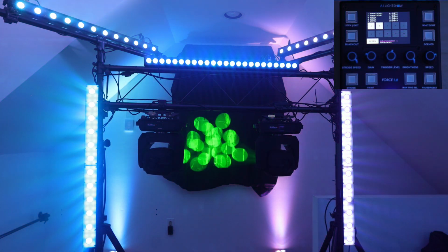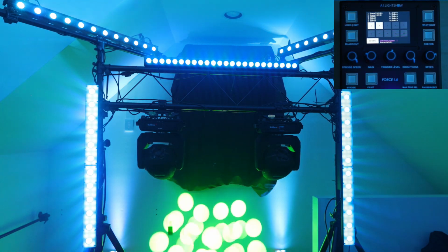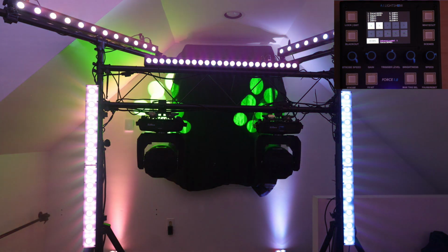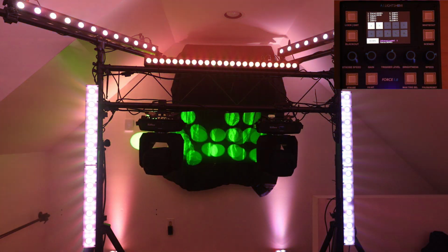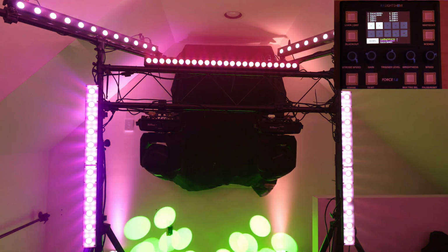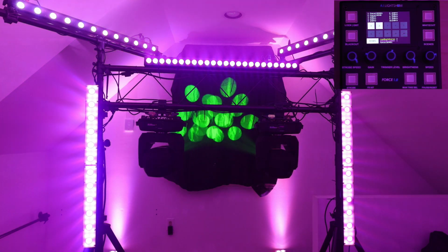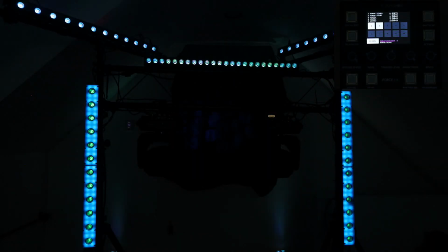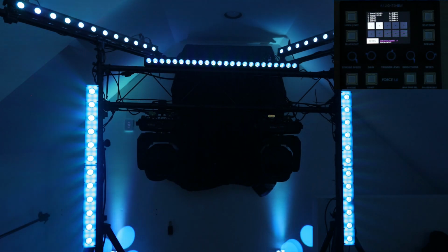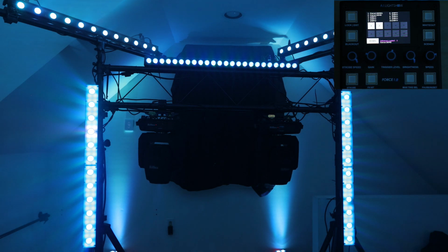Now this is an extremely powerful tool that can be used for many different use cases. I'm just providing one example here. And what we'll do now is we'll load back DMX Universe location number 2, which is called Force 1 Demo, where my moving heads are confined to point towards the camera. Simply press that button and you'll notice the light show is still operating in the background. Once it's loaded, you'll see my moving heads begin to move to the new confinement range defined in this particular universe, which is the moving heads pointing in the vicinity of the cameras.